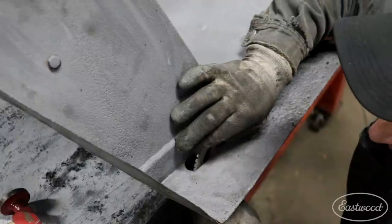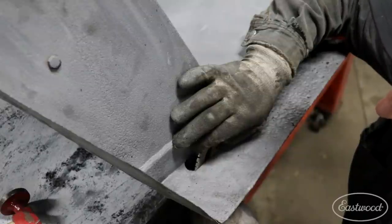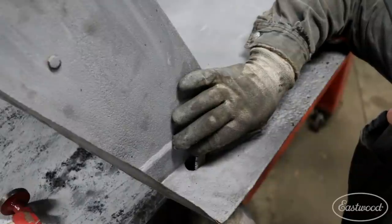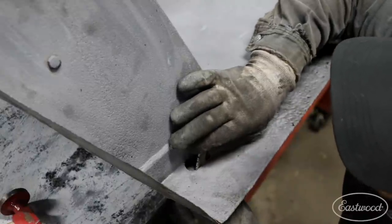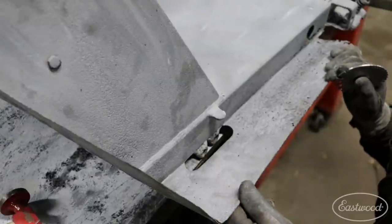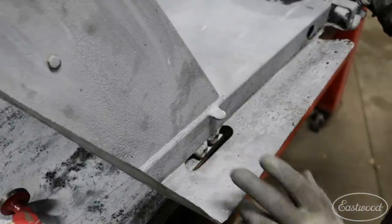So we try 15 gauge - it does slip over there but there is a little bit of play, which is telling me it's just a little thicker. We'll go to 17 gauge - got a little play too, which is an uncommon size. There we go, 18 gauge - feels to be a nice tight fit, no play at all. So this is actually 18 gauge. I thought it was a little thicker, but I think with the way it's folded over on the edges - it's got a hemmed edge - and with the bends here, it actually has quite a bit of strength in a little area.